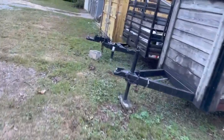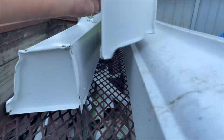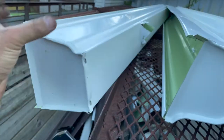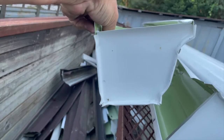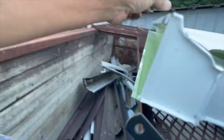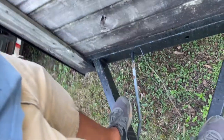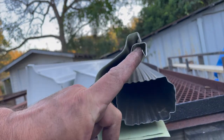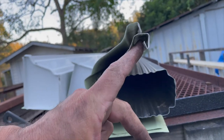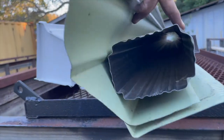For those of y'all who aren't familiar with it — that's a used piece, but you can see right here what they look like. This is the front lip of the gutter, and that box with the series of small rollers forms that lip — it makes a little lip underneath here. Those rollers form all of this, but specifically that little lip right there, because that's where you hook your hidden hanger in as the fastener goes across and then screws onto the house.